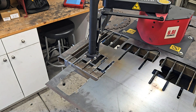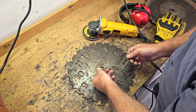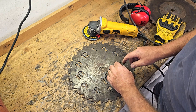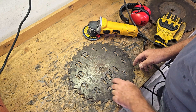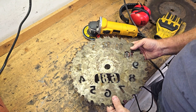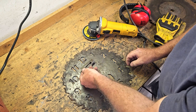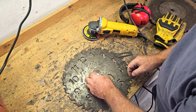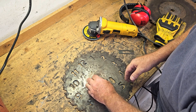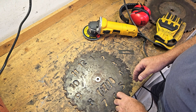There we go. We've got our two pieces cut. Here's the little standoff - like a picture frame mount. The mechanism for the clock is five eighths of an inch deep, so I'll bend these and it'll hang from that. This is my cutout - the pieces of metal that were retained literally just popped out. Settings are pretty good, very little dross. I'm going to knock that off, then we've got some welding to do. The clock mechanism center is a little too small for the hole, so I'm going to tack this washer in there to make it fit better.